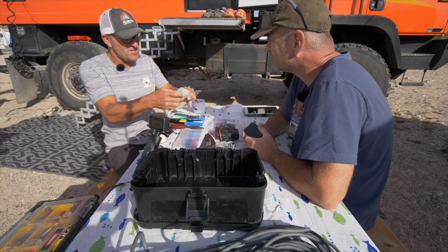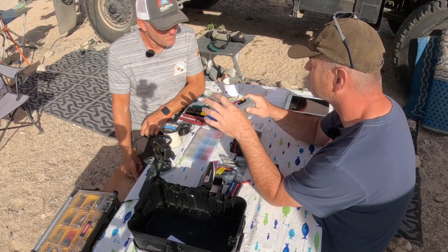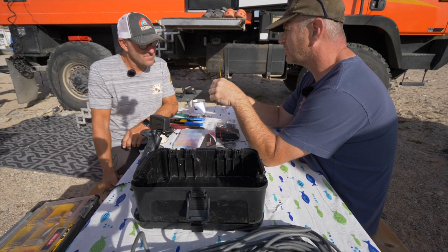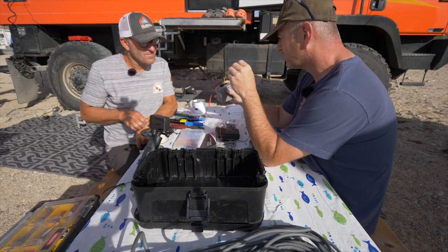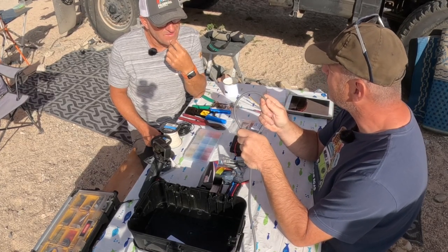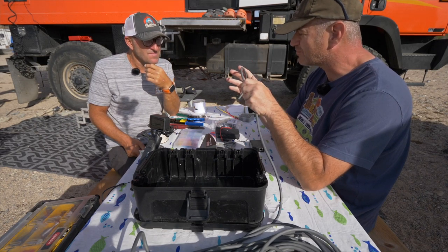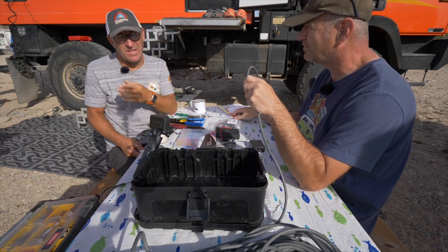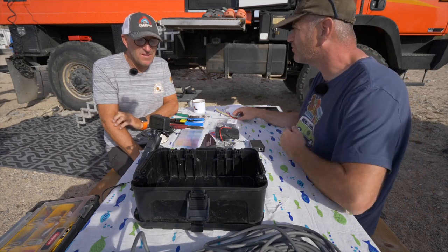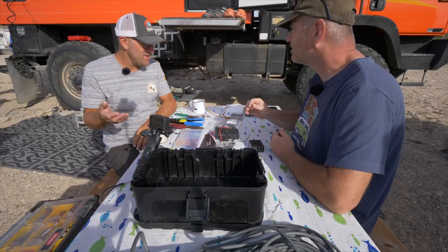The reason the dish takes 48 volts: if you look at this converter, the gauge of wire from the 12 volt input is much bigger than the 48 volt output. That's because the same amount of power running through 48 volts requires a much lower amperage than running through 12 volts. The Starlink cable has eight very small gauge wires — if you run a lot of amperage through them they'd get really hot and melt the casing. Cables can be 75 to 150 feet long, so higher voltage at lower amperage is necessary.